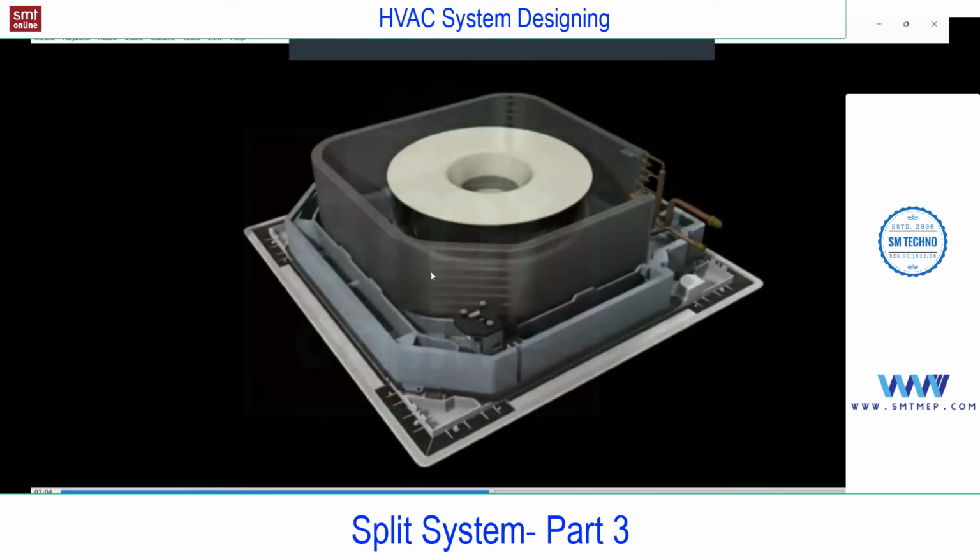Now you see, you'll find this evaporator coil. On the evaporator coil, condensation will happen, so water is going to be collected at the bottom, and this bottom we can call a drain tray. You'll find the passage for collection of water. But the important point is that, unlike the high wall, we cannot connect the drain pipe directly because this is going to be installed in the ceiling. In the high wall, it is going to be on the wall.